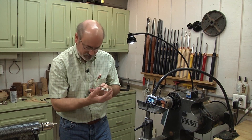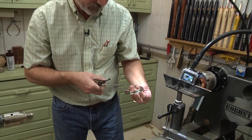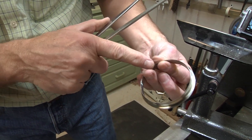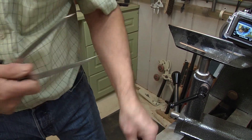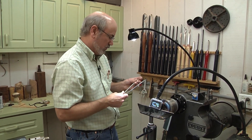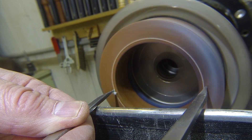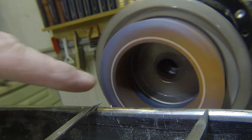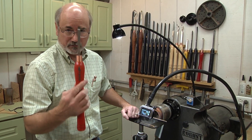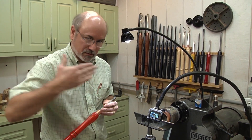Now I'm going to take one of the bangles and get the diameter. You could use regular calipers or gauge calipers. In woodturning, sometimes close enough is good enough, but in this case you've got to be really close. That's the diameter of the ring - the part that's going to slip inside the wood. I'm going to turn the lathe on and bring these caliper points up. One is sharp, one is dull - very important. I'm only going to touch the sharp one to make a mark. Now I'm lined up. That's where I want to start cutting in with the tool, and the tool we're going to be using is the easy wood tool with the perfectly square scraper carbide tip edge. You want the one that is perfectly square because you need to make very accurate lines.